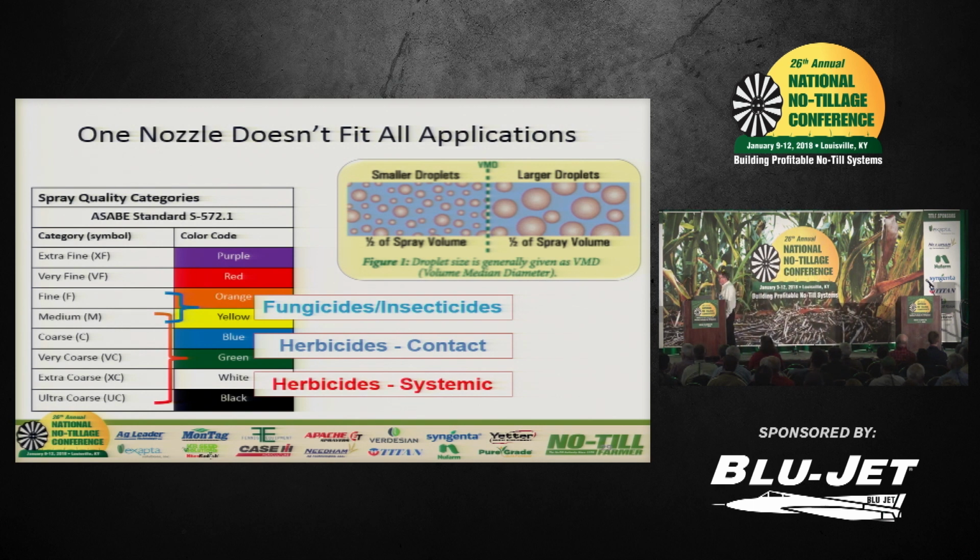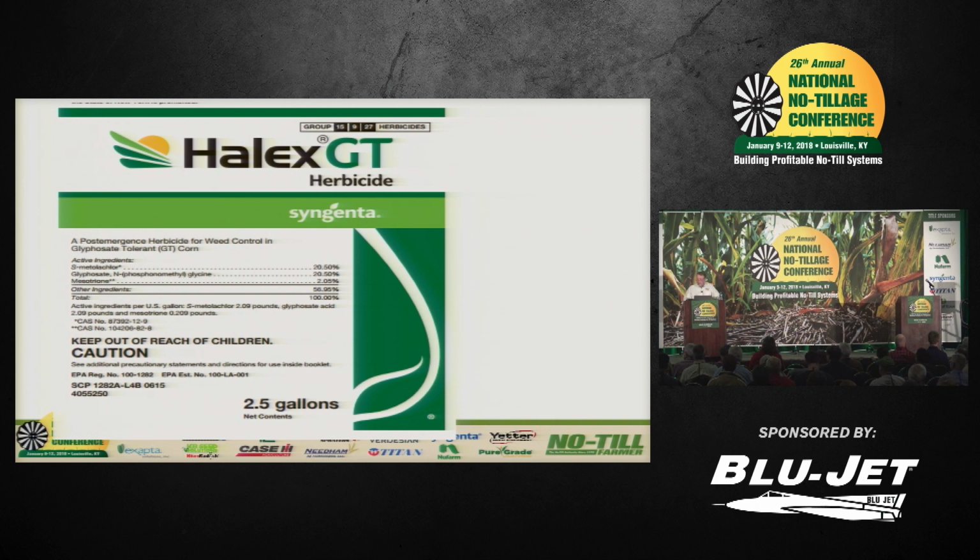So as an instance, fungicides and insecticides need more coverage, so they're going to require smaller droplets on this quality scale, like fine, medium. Herbicides that are contact in nature would be more like medium, coarse, possibly very coarse. And systemics like glyphosate, like dicamba, like 2,4-D, can function with bigger drops, and so they're on the bottom of this scale. Now, that's the whole focus of what I need to talk to you about, because one nozzle won't do all your jobs because of the products.